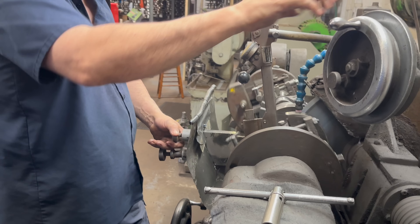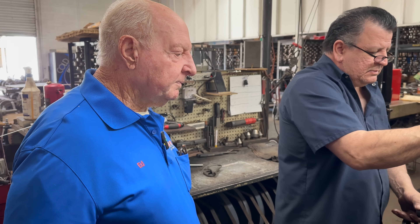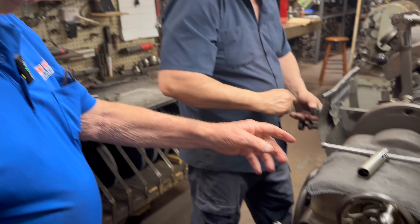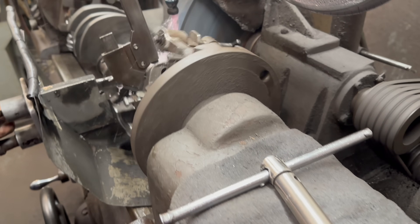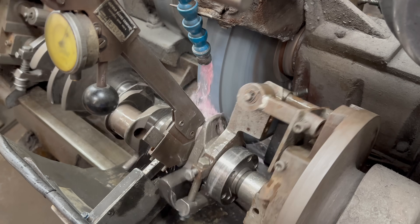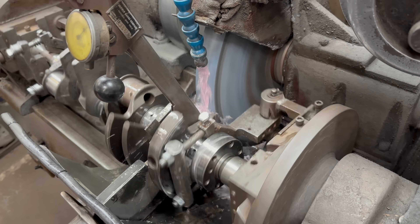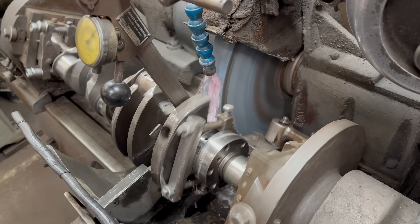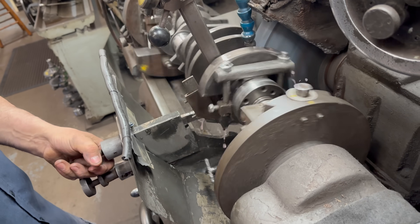What this is, as he's grinding the rod bearings — this band on the end of the crankshaft has adjustables on each end that offset the crank, so the rod bearings set straight and the mains go oblong, around and around. So you can choose whatever you want to be in the center. That's right.